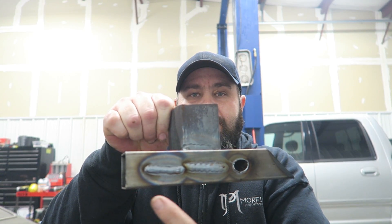Now that you guys are equipped with the knowledge of basic wire feed settings and voltage settings, you can grab your welder, grab a couple pieces of metal, start welding on a flat piece of metal doing some beads like I did. Run yourself some sample test beads and see how they look - see if you're going to blow through the metal or not putting enough heat in. Scrap metal is super important, so make sure you have some. Get yourself a welder, whether it's flux core or gas - you're going to have about the same results. Flux core is a little bit dirtier and you'll have to clean it with a wire brush to see your results, but with gas you won't have to do that.